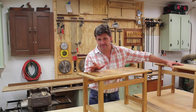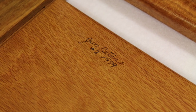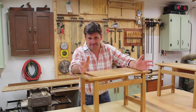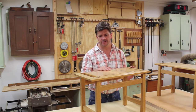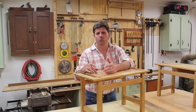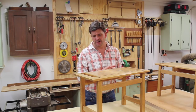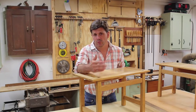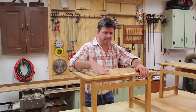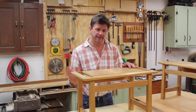These are two white oak benches that I designed and made more than 15 years ago. I'm glad I signed and dated them — seeing 1999 on the bottom is a good reminder of how fast time goes by, and it's just a good habit to get into. I ran into the client the other day, who's now a good friend of mine. He explained that one of the benches has a small water ring, barely noticeable. I went over to take a look and felt I could take care of it pretty easily by lightly sanding the benches and giving them another coat of Waterlox, which is the original finish — a wipe-on varnish. As I work on them, I'll talk about some of the design decisions and joinery, and then we'll deliver them to the client.